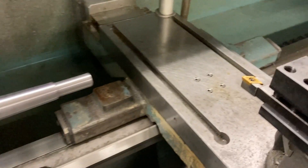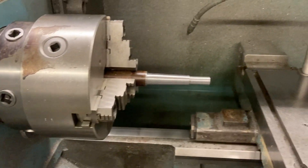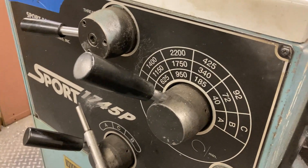I'm back, going to take a finish pass now. I changed the tool and we'll take that finish cut. I increased the RPMs — we roughed it out at 625, we're going to finish this at 950. Program's in place, ready to go.